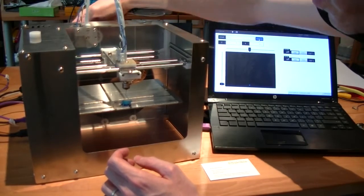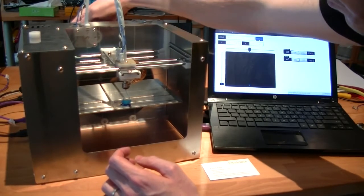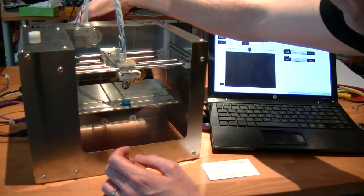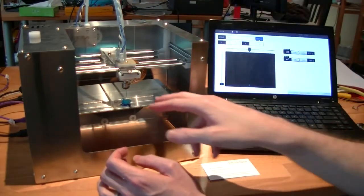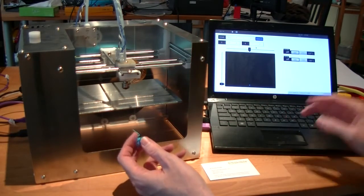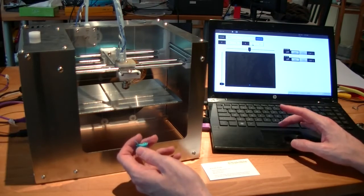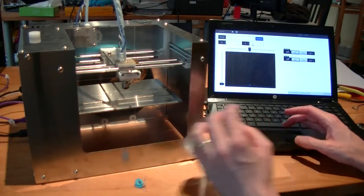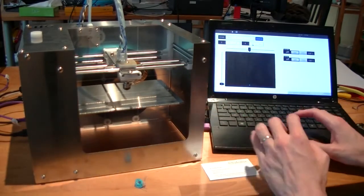Now we just changed this nozzle we've used before, so you can see it push purple out. And so if you're feeding it by hand, basically you just want to back it out a little bit after you're done. If you do it through the console, just back it out about 15 millimeters. So on FIDE, the default, it would be hit minus about 3 times and you'll be good. Okay, now back to initial calibration and everything.